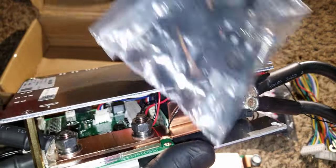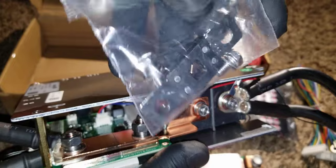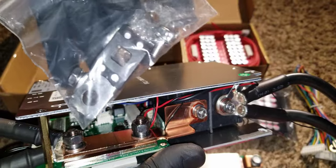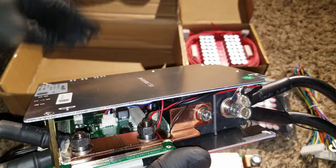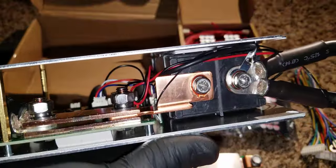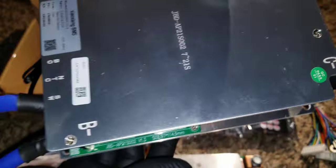They gave us a 400-amp inline fuse — because these are 300 amps, it'll surge if your inverter surges two or three times the capacity. This fuse can blow instead of ruining the BMS, which is the brain for regulating how the batteries are supposed to be charging.